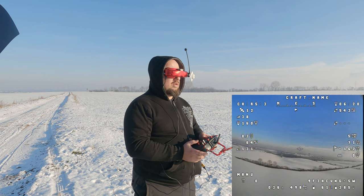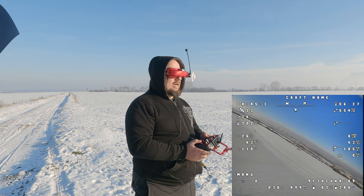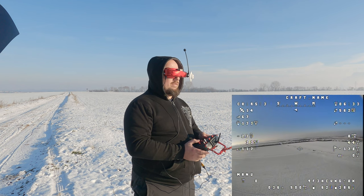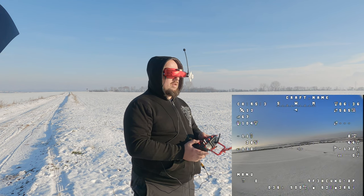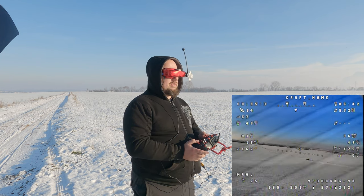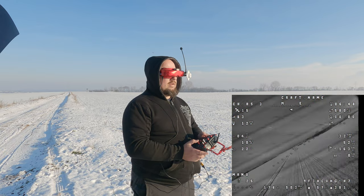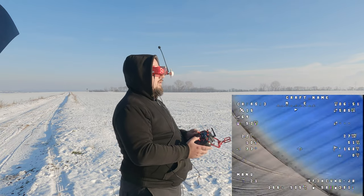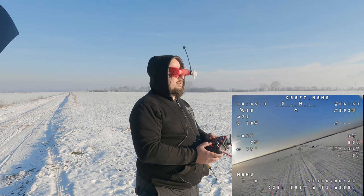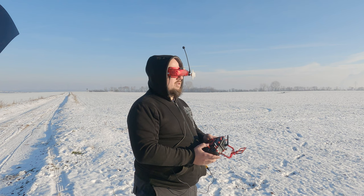This is really helpful especially since the control surfaces are near the root of the wings. I didn't fly too long — it was getting very cold. I decided to go home to change the mixer settings and control surface throw to get more agility for the next flight, which is also why I didn't do an auto-tune at this point. I came in for landing, and it was a very easy and smooth landing even with a slight tailwind.